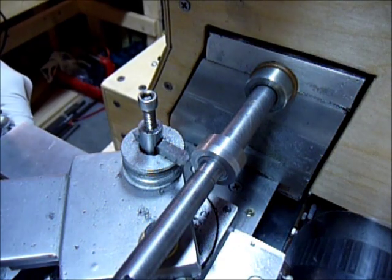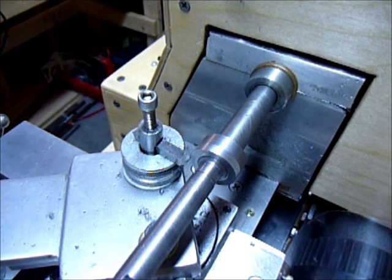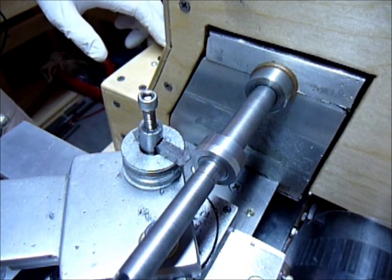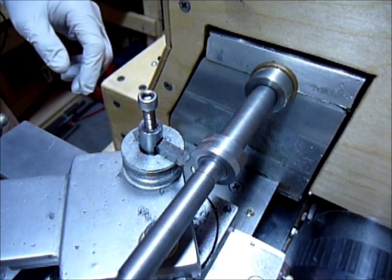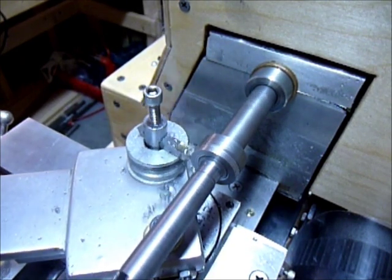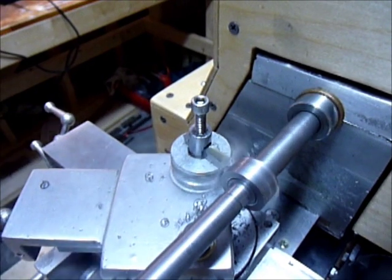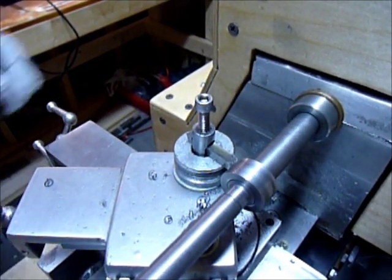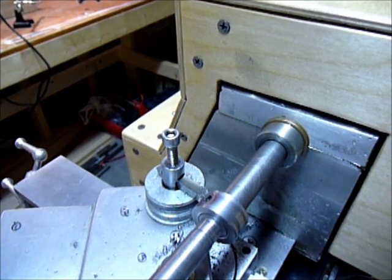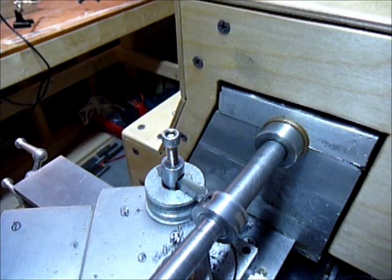One thing I noticed is that because I have no micrometers on the hand wheels, it's really hard to adjust the cutting depth — I'm going to have to figure something out for that. Relatively annoying. So here we go — put a little cutting fluid on there. This is 300 RPM. That little knocking sound was going over the set screw, which I believe to be a different type of material.